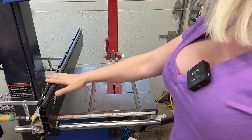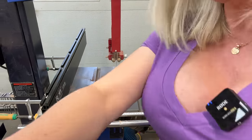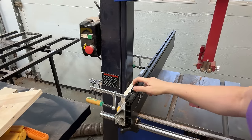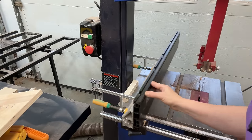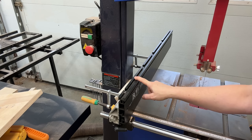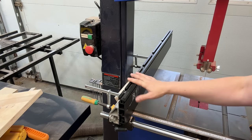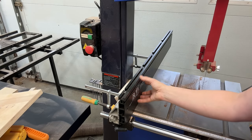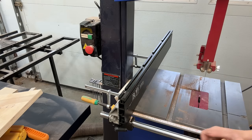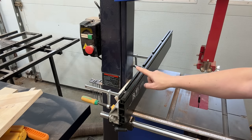I did put a bow auxiliary fence here — you can see it's a lot taller than the original fence. This fence can attach to any band saw and even a table saw if you need to re-saw or want more support. These things are fantastic — they give you a taller fence and help with re-sawing a lot. I'll put the link in the description below if you're interested. I use it all the time.